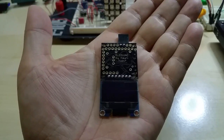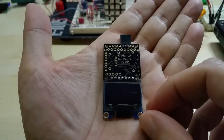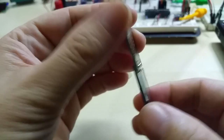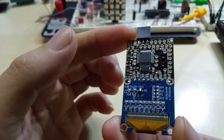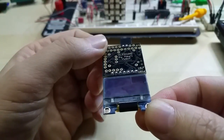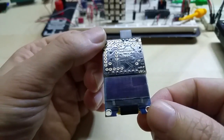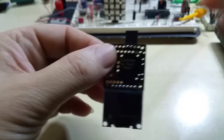Hello YouTube, this is my OLED tachometer that I put together to put on my hard disk grinder, which I will show you in a second. This is my Olediño PCB that I use on most of my projects, and this is a SPI OLED display, 0.96 inches.